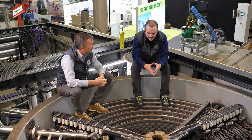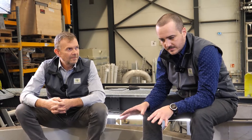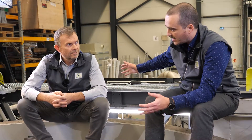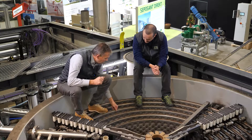Here we are in the heart of our evaporator. Here you see the evaporator system where the digestate is filled in and then these plates — these heat exchanger plates — heat up with the power of the external heat and evaporate the water and the ammonium. Here we see the heat exchanger plates.